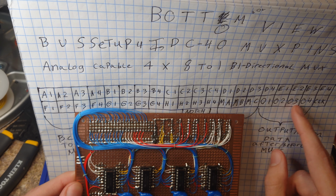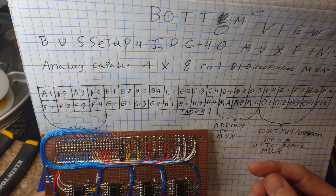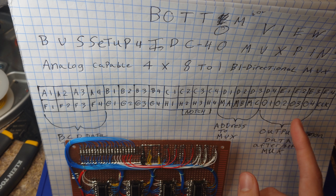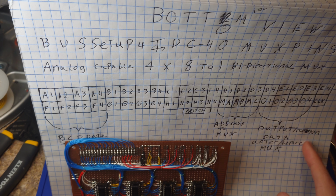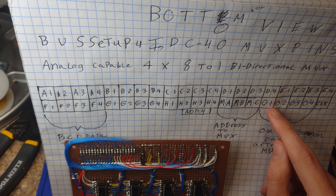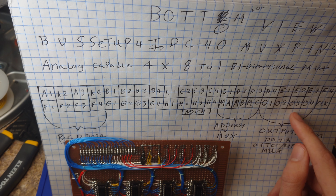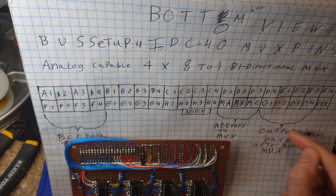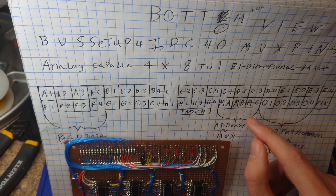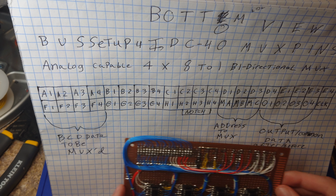This is what actually goes out to the display driver, and in combination with the address select, tells the display driver, or whatever it is that we're multiplexing to, what digit is actually being represented on the data payload out here. So in the case that we had 0, 0, 0, and we had 1, 1, 1, 1, that means we would have the full 15 out on the bus, or the 16th position, depending on what the data is actually doing, and it would be on the very first digit. That is to say, it tells exactly what digit it is. You can probably guess what it does.